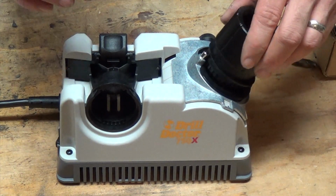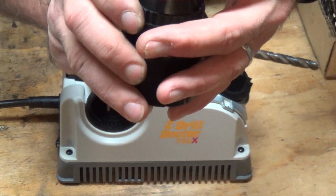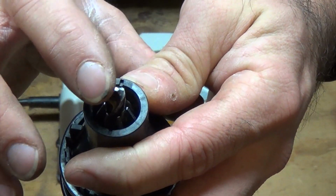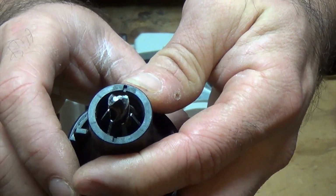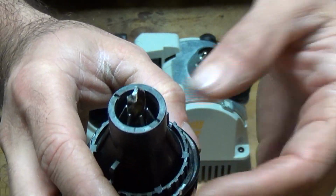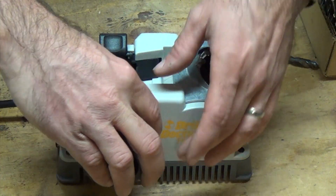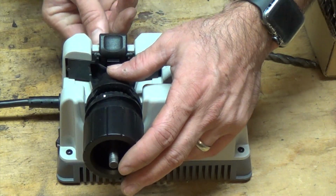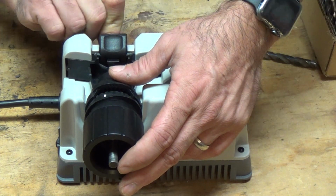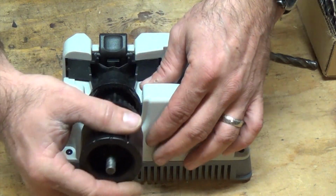Alright, as you can tell, I wasn't hearing anything anymore. I was pretty sure that this thing was not 118 degrees, and if you can see there, it's only sharpening right at the very point of this, which means it's definitely not 118 degrees. So after we stopped hearing it like that, we're going to put this thing back in here and take a little more off. And I'm actually going to back this screw off a little bit so that we're taking more off than that. That way we've actually got it to where it needs to be.